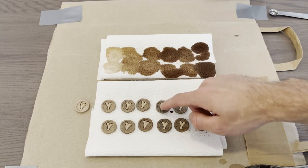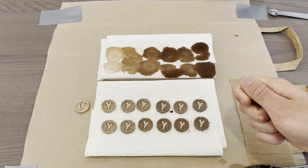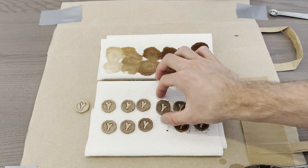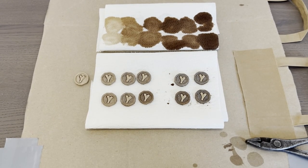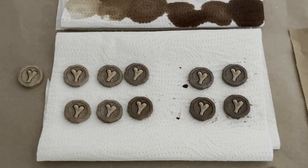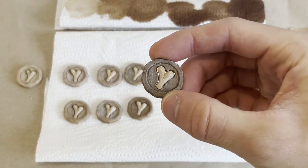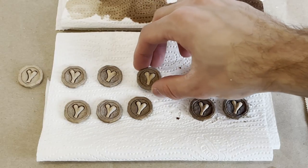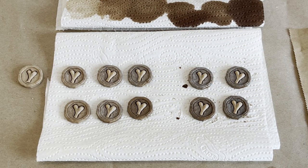Also, these two coins stand out being much darker than the transition above would suggest, so I'm just going to remove them. The tricky part is finding a good color that works in both bright and dark settings. In a dimly lit room, the leftmost stained coin looks the best, but when I turn up the blinds, that coin looks too bright. After comparing a few coins, I decide on the best middle ground — a 50-50 mixture of white and middle brown stain, which makes it easier.